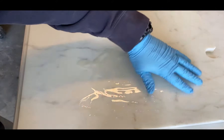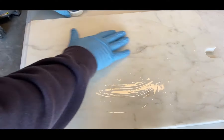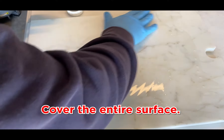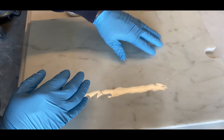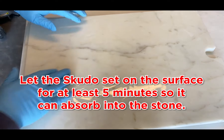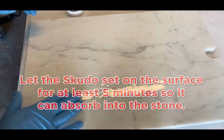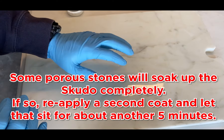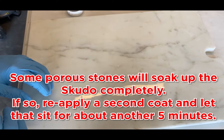For general applications, you'll want it to go into the marble. We're applying it to the stone and you want it to cover the entire stone area. You want it to set on the stone almost puddling — you can see how it's kind of puddled up on this surface. Let it set like this for at least five minutes so that it will absorb into the stone. If certain stones are more porous and it absorbs completely in, you can apply more and let it sit until it stops absorbing, for about five minutes.